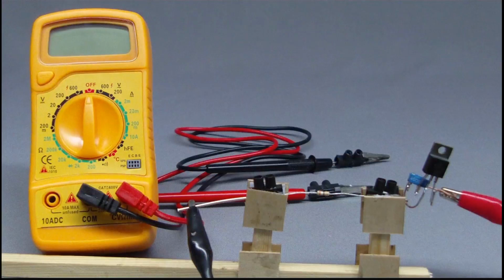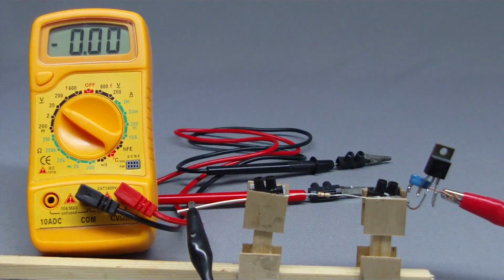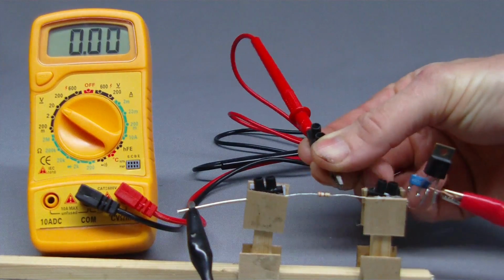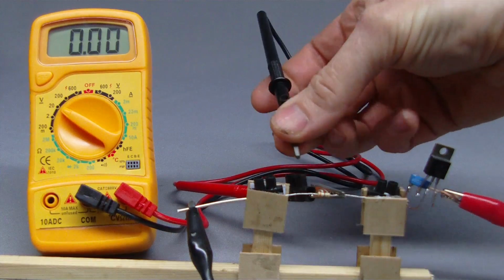The multimeter has to be switched to the functionality DC voltage to be able to measure the voltage drop at the resistor. Set the range selector to the highest position if the value scale to be measured is unknown beforehand. Now you can connect the multimeter in parallel to the resistor with the help of the test leads.